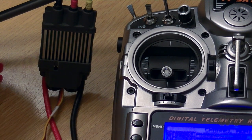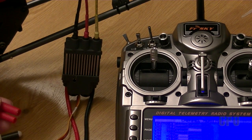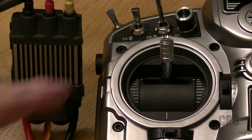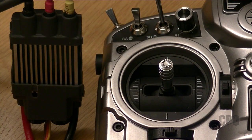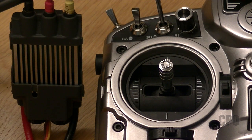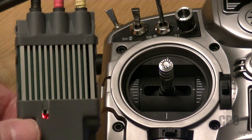Now we'll go into the actual stick programming. We'll enter into stick programming mode starting out the same way — throttle goes to the high position when you apply power to the ESC. And then we're going to do a series of mid-throttle, high-throttle, mid-throttle to enter the programming mode. Now we have the steady beep with the flash that tells us we're in programming mode for setting number one.